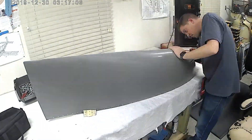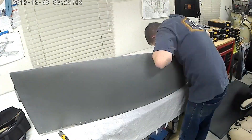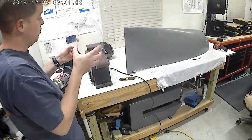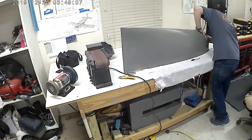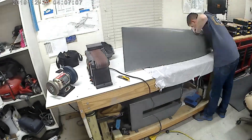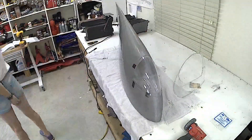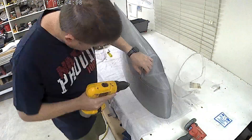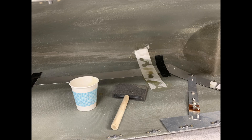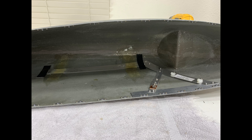I have yet to connect the coax — I am dreading that, so I just pretty much put it off. Here I'm cutting the glass out. I have a short on it too, and I'll link to that up top. I found that you needed to cut in a weirder place than what I initially thought. You can see there I cut more towards the top than the bottom of the original piece. Here's the VOR antenna, and then the next one right here is me starting to glass it in. It's just one strip there and one strip off to the left-hand side. And there it is finished — you see that second strip that I glassed in. Let it dry, peel the tape off. It's good to go because it's also riveted on the front edge.